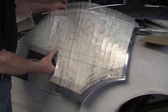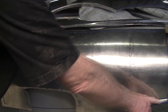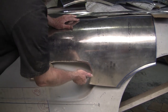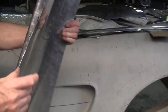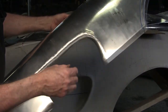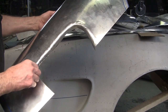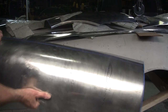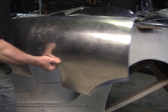This is Rob's panel — that's the flexible shape pad he made. It still needs a peak put on it. We've got the wheel opening flare and the flange underneath. There's this cutout feature we basically pounded in by hand from the backside with a caulking tool. That has to be planished out nicely. You can roll it in with a narrow English wheel roller and walk around it a bit. Rob did a really nice job — he's got all the radii really close.